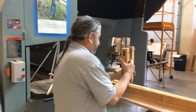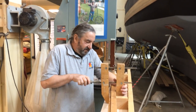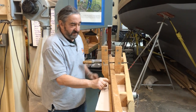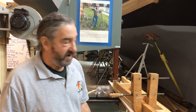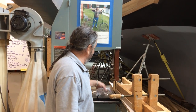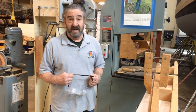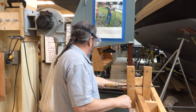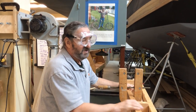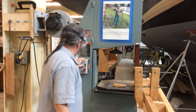What does 12 to 1 mean? It's 12 times the thickness of this piece of wood in length. So if the thickness was 1 inch, the length of the joint would be 12 inches — a 12 to 1 ratio. That's governed by strength: the stronger the joint needs to be, up to a point, the longer that length is going to be.